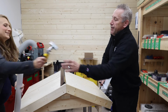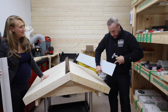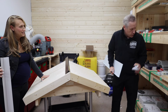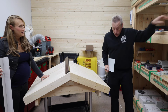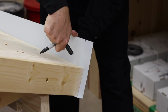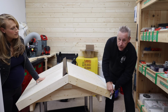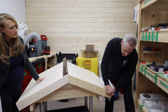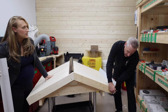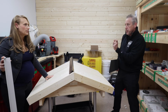You've got all the tools. The bender would fit and then bend the steel. By making that nick at the top and the bottom, it'll curve right over, and that creates an L shape there, which you can then just slide right into place on the corner of your eave. You don't need to go in more than a half inch or an inch just to cover that edge. And then the flying gable would come down, we'll show in a second, over top. Why we want to do that is we want to try not to leave exposed edge. So if you cut to the edge and then cut to the edge, that part there, it butts. And a really skilled tradesperson might be able to handle that.